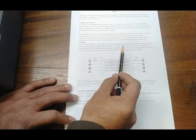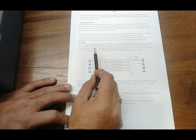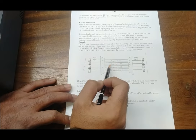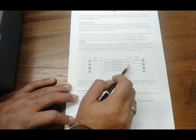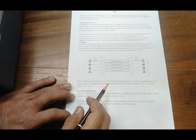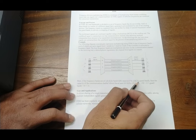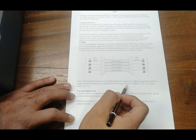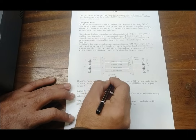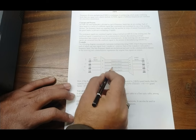As an example, the diagram shows FDM with four frequency bands, each carrying a signal from one sender. Two receivers each receive from four senders allocated frequency bands 1 through 4. The four frequency bands are multiplexed and sent via the communication channel, and a demultiplexer regenerates the original four signals at the receiving end. For example, with a 150 kilohertz bandwidth per band and 10 kilohertz guard bands, the total channel bandwidth required would be 630 kilohertz — 600 kilohertz for four bands plus three 10 kilohertz guard bands.